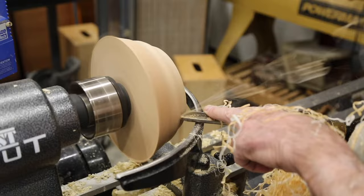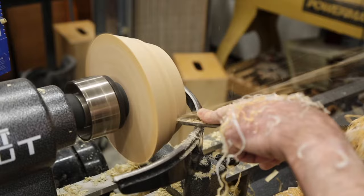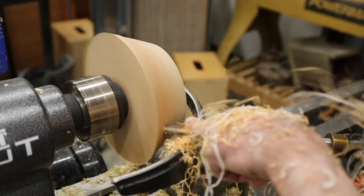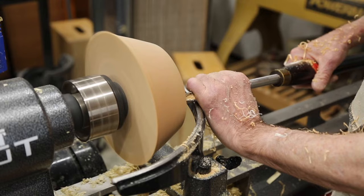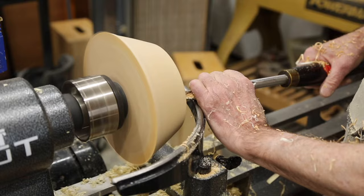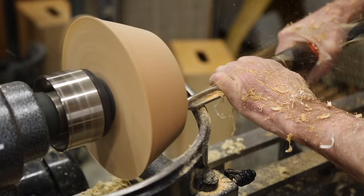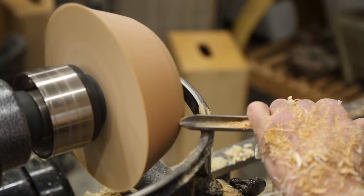Do not try to pull it with your left hand — the control is in the right hand. A good technique is to simply put two fingers on the gouge and push with your right hand, and it will cut just as nice as pie. To flare the rim, move the handle to the right and you can flare it out and create a reverse shape. To cut the bottom curve through the S-curve of most bowls, you start way over here and bring the handle towards you, then go right up the wall.